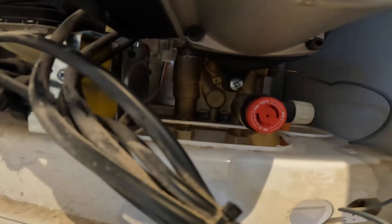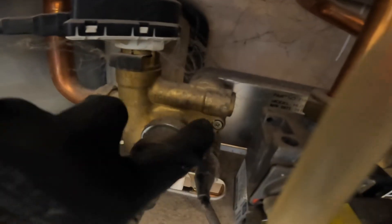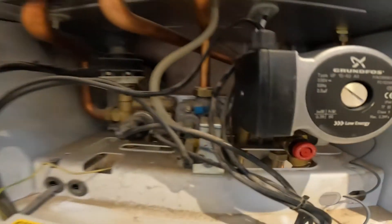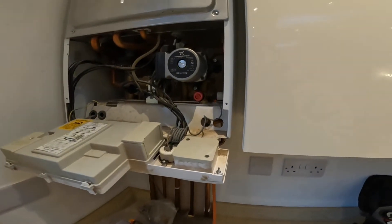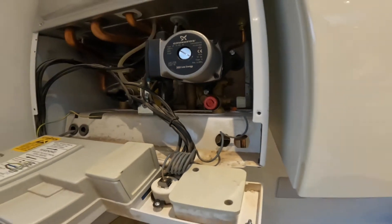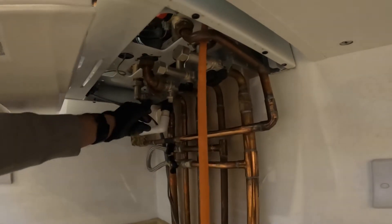There's one small screw on the left that screws onto the heat exchanger plate, and the same on this side here. You open those two screws, take the heat exchanger out, and lift it over the side past the motor. First things first, you just drain the boiler — all the water that's in the heat exchanger. Turn the flow and return off.